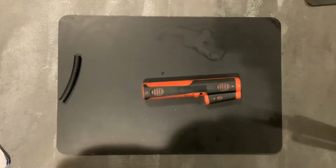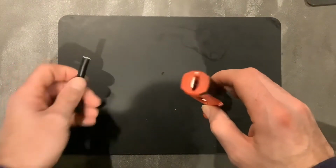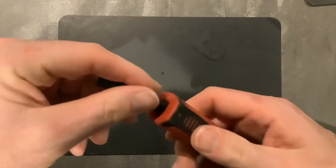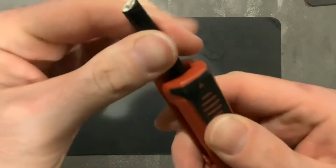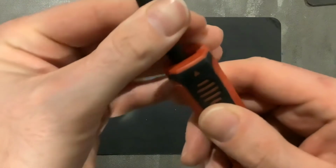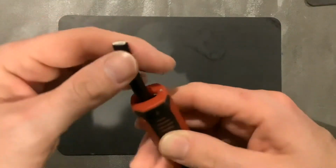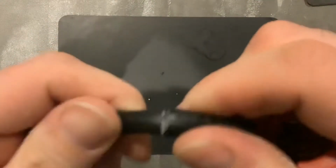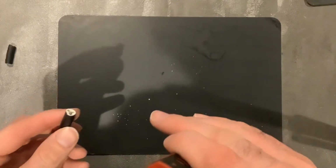I have here some flexible cable which I'm going to use the sheathing removal tool to score the end of the cable and cut it away, hopefully nice and neatly. So you just pop it in the end there and apply the pressure as you rotate either the cable or the tool gently, as you don't want to score the internal conductors. So you go around, as you see it scores the cable for you, and when there's actually cable in there it's a bit more brittle, so it will break open a bit easier, but it is very good for the job.